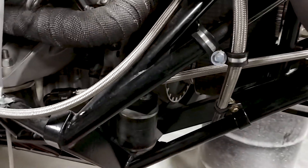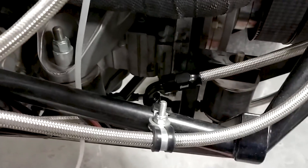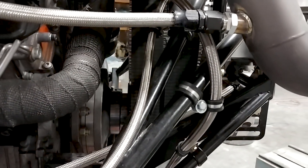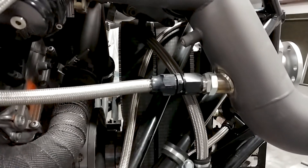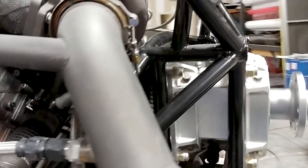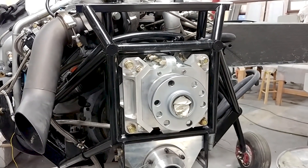You've got the oil return and the oil feeds in place. It'll come off again but possibly we may run it before it comes off. I did order the oil-impregnated bronze rings for inside the drive from Barry - they'll take about three weeks to arrive, and that should fix our problem, because if they do touch the shaft they'll just wear down the way they should.